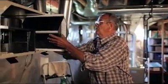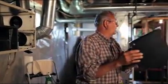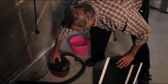So we take it out like this, and the first thing that we do is we hold it up to a light to see light through it. So that one's not too bad a shape, and then we turn it a quarter turn, and there again the same. Now this one is the side where air was coming in, so that's the side that we'll vacuum. There's 2 ways that this can be cleaned.